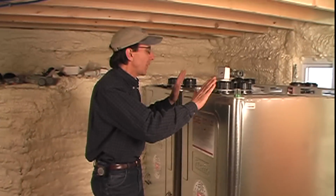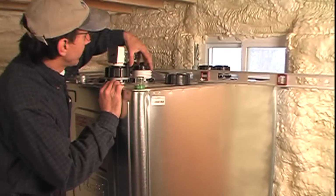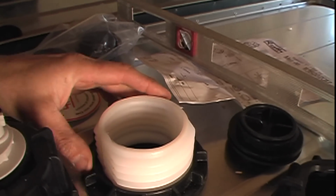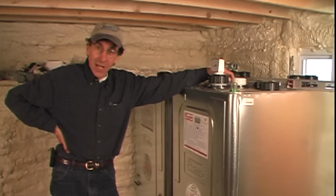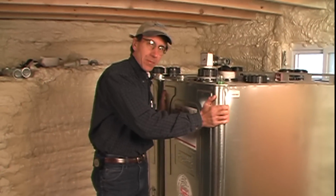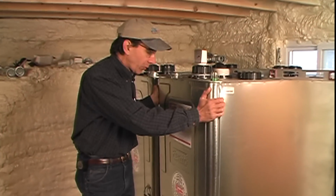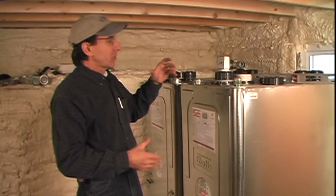The real reason is these tanks are plastic tanks. I can show you here if I take one of these big things off. This is the actual tank. The tank is a polyethylene tank. They're made in Germany, and my understanding is that in Germany they use the bare tank for oil storage and have for years and years. They stand up very well. In our country we have them as a dual containment system, where we have the plastic tank, but around the outside we have a galvanized liquid-tight tank as well. So it's a dual containment system.